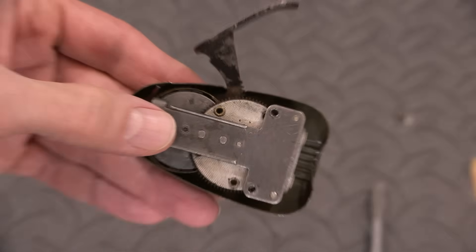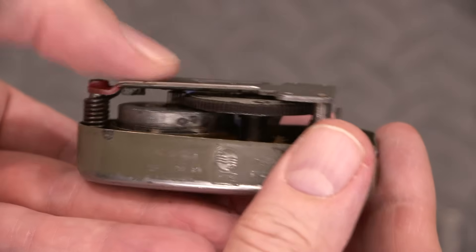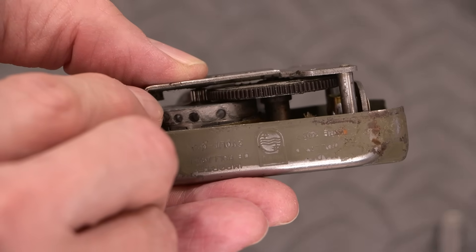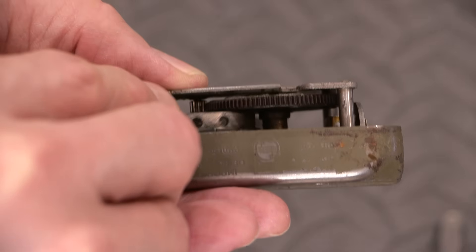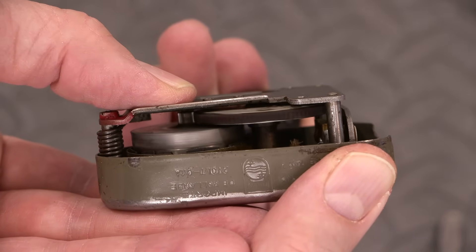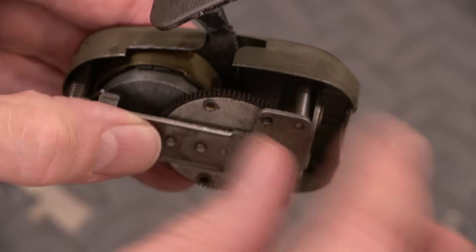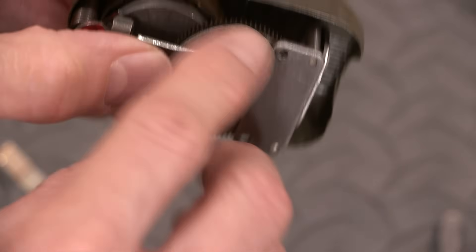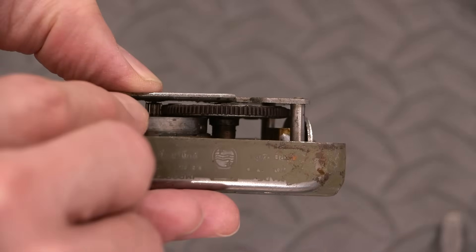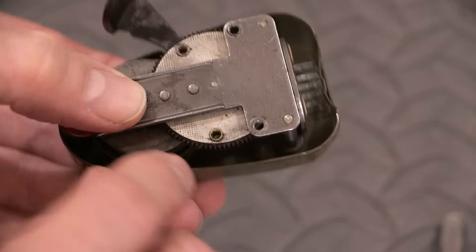Let's take a closer look at what we have inside this. We can see the little dynamo back here — or generator if you like. And some pretty crude balancing — look at that. The gearing looks really nice. It doesn't look like any teeth are missing. This looks to be a fibrous type of gear up against a metal one. The reason they've probably done that is it would create a lot of noise otherwise, so this cuts the noise down quite a bit.